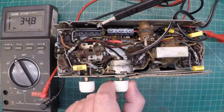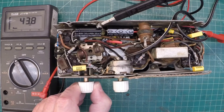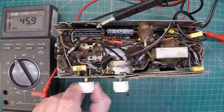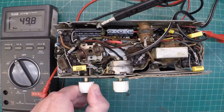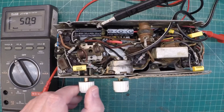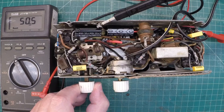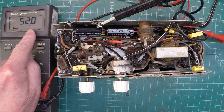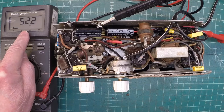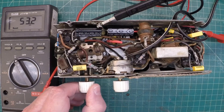Let me make sure I've got the volume turned up on the receiver. We can actually hear some noise now. Looks like another day of thunderstorms — you can hear the thunderstorm warnings coming out. Pretty amazing, this thing is playing. You can hear a little electrical noise from the storms in the background, only with B-plus at 52 volts, and the radio is actually playing pretty well on a low B-plus.